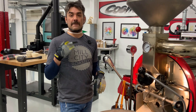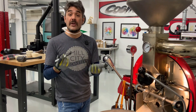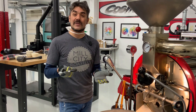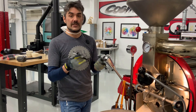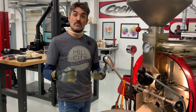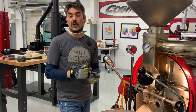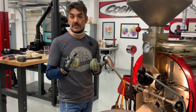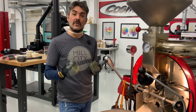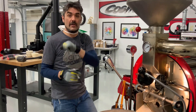Then we're going to fire it up — full gas with low air. We're going to purposely try to malform the drum a little bit to recreate hard roasting conditions. If we bring the drum up to temp and we don't hear rub, we're basically good to go. I'll run a slightly longer warm-up listening for rub the whole way, and then I'm just going to go in and roast to charge. We'll see when we roast to charge really what's going on. I'm going to get into the drum gap adjustment because I do have some coffee to roast — I'll see you all in a little bit.